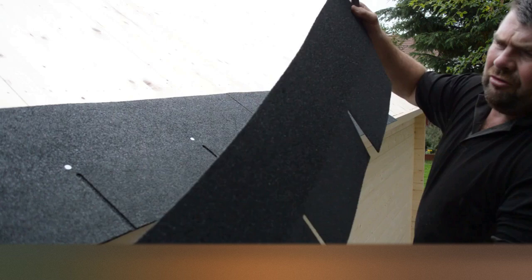The second row must be placed directly on top of the first row, but making sure that these are stepped so as to cover the slotted pattern and no wooden roof boards are visible. The next row should go about halfway up, using the top of the slot as a guide to place the bottom of the shingle sheet.